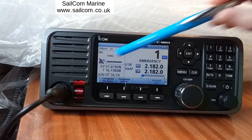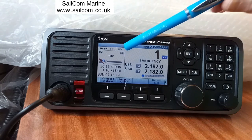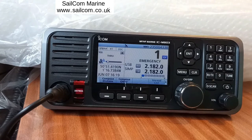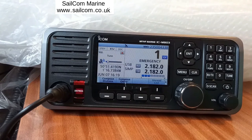The volume is currently turned right down, and set to through because we haven't tuned the aerial tuner unit, so the antenna is bypassing the ATU. If you just want to receive and listen around, it's best to have through selected. We also have the Squelch on, so we turn the volume up and get no noise out of the speaker. To tune the aerial tuner unit, change to through, press Tune. Tune flashes and once tune is on, we've now tuned.